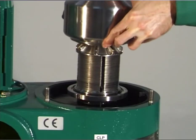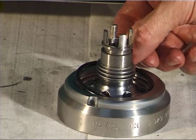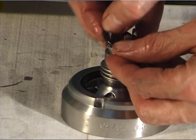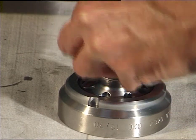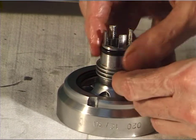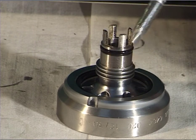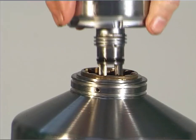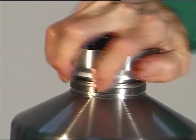Fit the bowl shell together with the bowl shell insert. Fit the two gaskets in the grooves of the threaded ring. Grease the gaskets, guide surfaces and threads as specified in the lubrication schedule. Screw in the complete threaded ring using the hook wrench, left-hand thread. Attention: a loose threaded ring can endanger life.